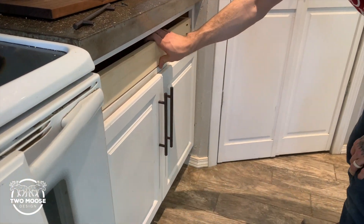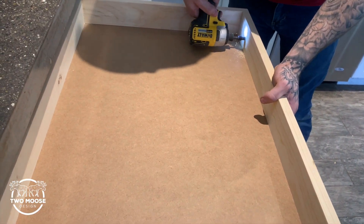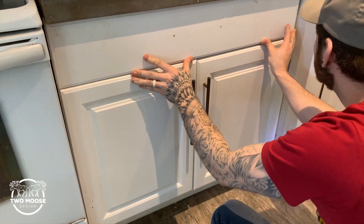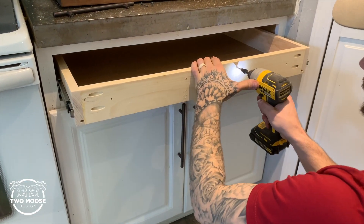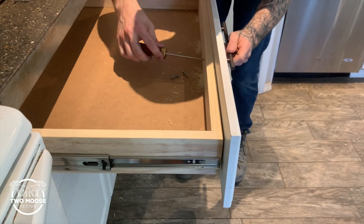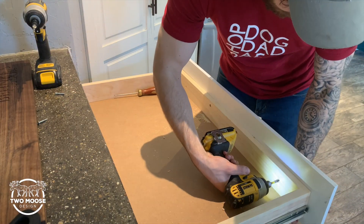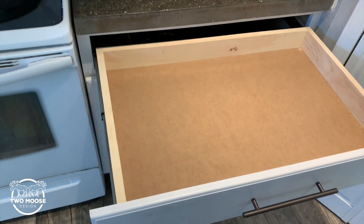Repeat the process on the other side, slide your drawer in, and open and close it a few times — everything should go in and out quite easily. Now I'm going to countersink some holes to attach the drawer face to the drawer. Line it up how you need it, drill the hole through the original handle holes and continue all the way through if it did not go through. Countersink the back side so the screws sit flush. Now attach the handle — I do not recommend using a drill unless you're comfortable, as you can easily strip these out. Once the handle is installed and everything's lined up, screw these in super slow. And that is it — your drawer is done! Open and close it about 400 times and then fill it with your desired items.